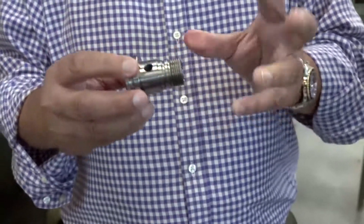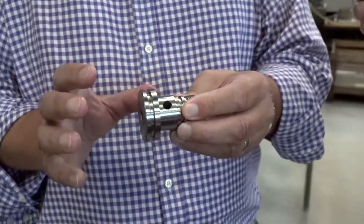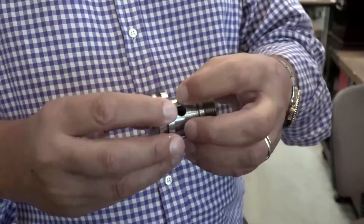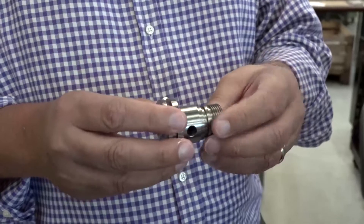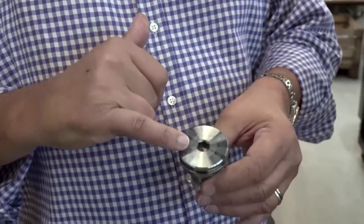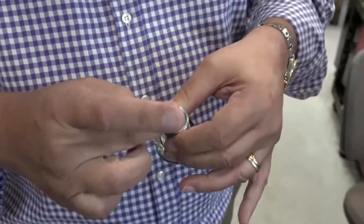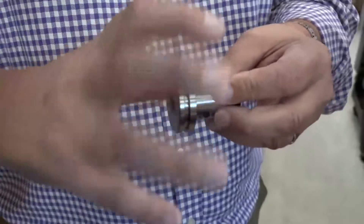Something like this component here has got a lot of detail on both ends. When you've got a triple turret machine you've got to try and balance the detail required on each end. For instance, if you only had a hole up one end and not much detail there, then lots of detail on the other end, it would be out of balance because as this machine picks it up and takes it to the other spindle it will have nothing to do.